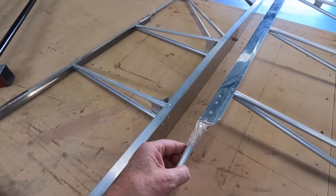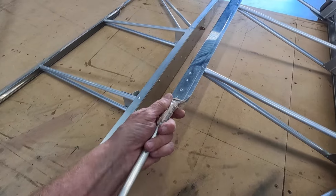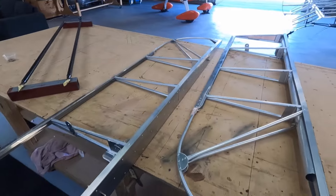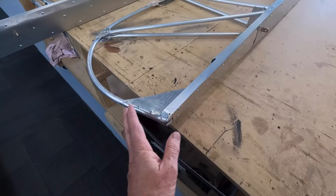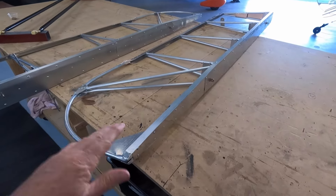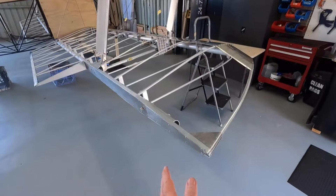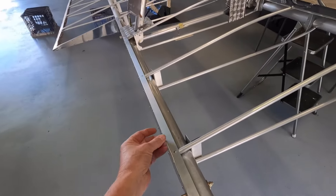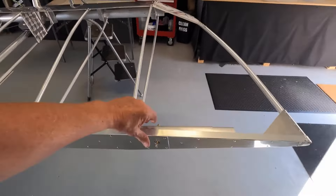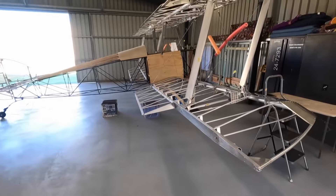Last night before I went home — not my proudest work — but I just used car body filler to fill this up and now I'll taper it down nicely to give it some nice flow. I can also build up areas with tape; this will all get wrapped up with tape. I did hit some areas with the angle grinder and yeah, it did more damage than what it was worth, to be honest. Just have to polish a few things up. Apart from that, we're going along nicely.